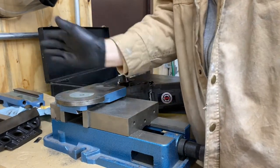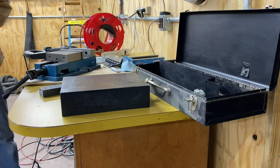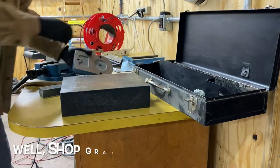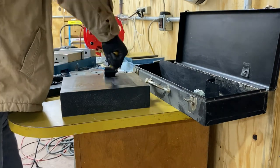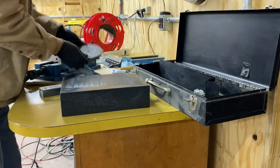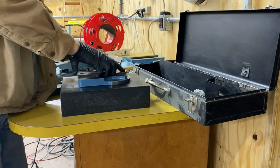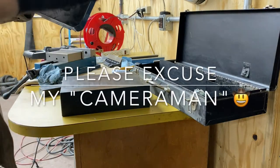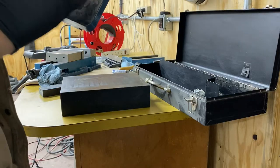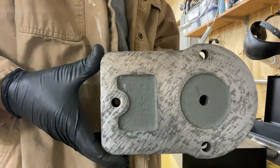I've gone all the way in one direction, now I'm going to come back and go the opposite direction, and then I'm going to ink it again. What we're going to do is compare this surface to my surface plate, which is machined to be very flat. I've got some non-drying Prussian blue — it's a dye. I put a glob on there, rolled it out smooth with a roller, put it on there, and let's see what we come up with. These are our high spots — they're supporting it so much that it doesn't touch any of the other areas, so we need to take down those places that picked up the ink.